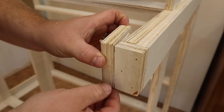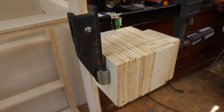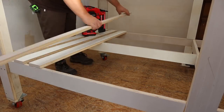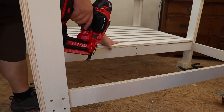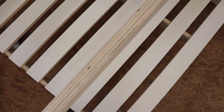In preparation for the two new casters I've ordered arriving, I need to beef up the middle legs a little bit to give the casters a big enough, strong enough surface to mount on so they do their job and don't end up twisting. The next thing I'm going to do is take what's left of the sheet goods from this project, rip them into three-inch wide strips, and cut them to certain lengths to add a slatted shelf on the main part of the table down below to give myself some material storage.